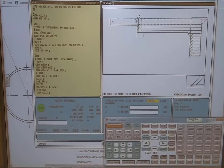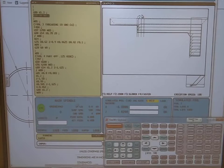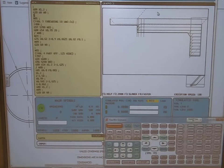My tool will stop right here at the end of the canned cycle, and then I tell it to go home — it will rapid home. Remember, dotted lines are rapid moves and solid lines are feed rate moves. That's exactly how I run that OD grooving cycle. Doing that right there puts this groove right where it needs to be before we do the threading.